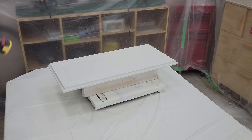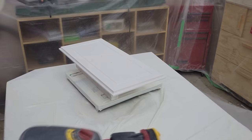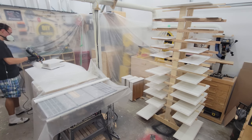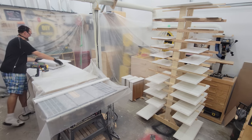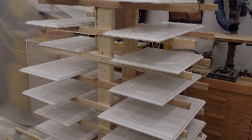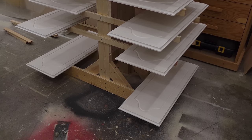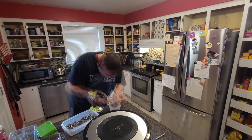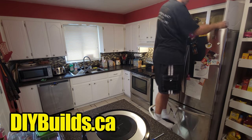In my experience a pneumatic paint gun never worked great, so I'm using a corded HVLP Wagner spray gun. This thing works amazingly and the best part is it requires no thinning — as thick as that paint was, the gun didn't care and did an amazing job. When I originally painted the cabinets years ago I used a roller and a brush, and man did that suck. I would 100% recommend getting one of these HVLP guns as they aren't very expensive and can be used for so many things including spraying polyurethane on wooden projects. Remember to subscribe and head over to diybuilds.ca to download free plans for any of my projects.